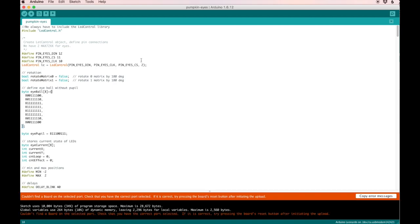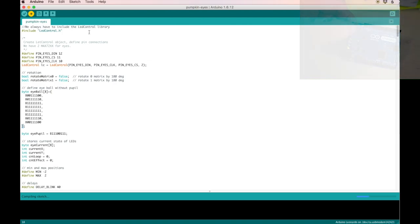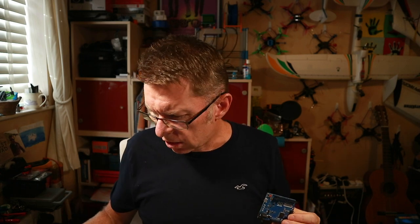From that point on, you should just be able to press the upload button and it should compile and upload to your Arduino. If you get a situation where it's saying it's not responding, it means it's busy running the program. What you need to do is literally what it says: you've got a reset button on the board — hit upload, then hit reset, and it puts it in a position where it's ready to receive the sketch. And that's it — done uploading. Nothing's going to happen yet because the LEDs are over here and we need to connect these together. Now we've got the code on the board, let's go into a close-up so I can tell you exactly how these all connect together.